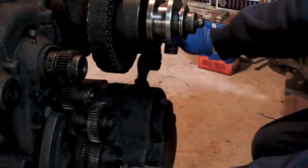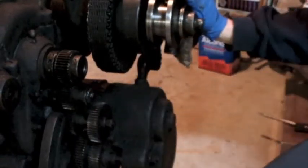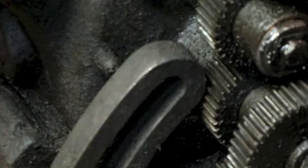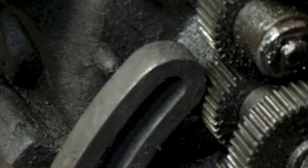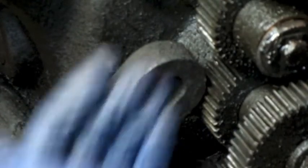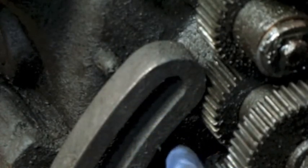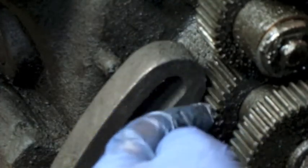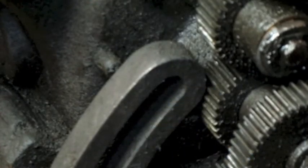Wow, I tell you what — this bracket right here almost looks like it's touching that gear. I just brought some more light over here and changed the camera angle and zoomed in. See this adjustable slotted bracket right here? Obviously you loosen this nut to move this in and out and engage it. But this is pushed up so far that at this end I can see light through there. So this is not touching these teeth, but it is really close. Let's see if I can stick a screwdriver blade in there.